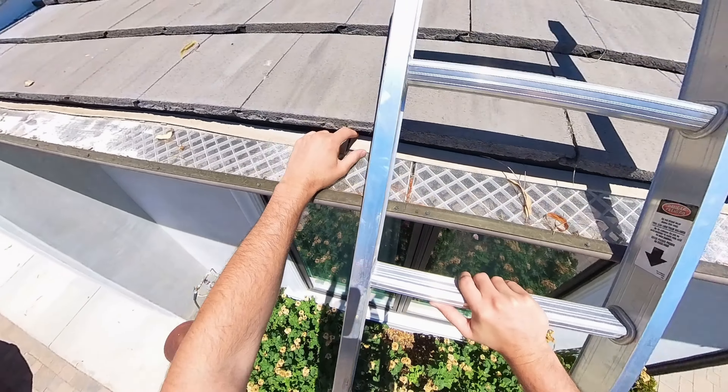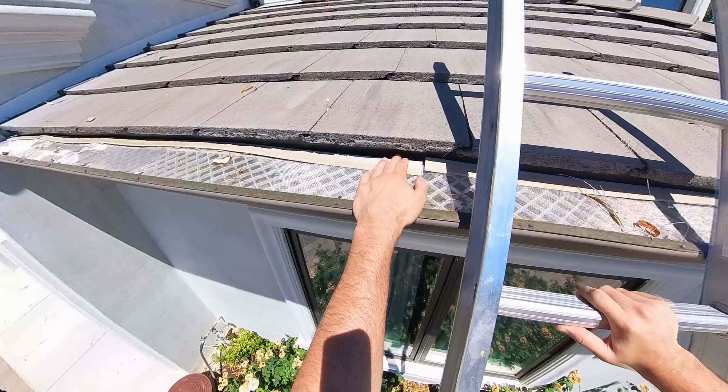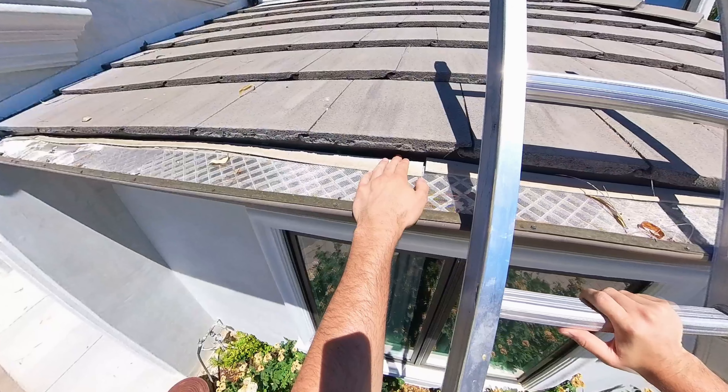There's a little riser metal here and gutter cover. When we're looking at where the gutter is, there's a tile riser metal. With all the tiles that overlap each other, once you get to the edge of the roof, in order to keep everything at that flat profile, if you didn't have anything to bump up the tile on the edge, it would bend down more than the other tiles and cause an area where it's just not sitting properly. So we install tile riser, which has little weep holes in it so that if water does get under to the underlayment, it has a point of exit. It's much better to use a tile riser metal than an extra piece of trim because it still has those weep holes and won't rot out if water gets trapped underneath the tiles where it meets the gutter.